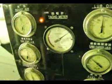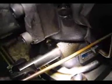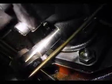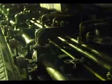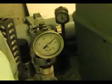Disengage the turning gear. Half an hour later, after primary lubrication blow-through, run the engine at no load. Check that all parameters are normal — there should not be any deviation beyond the limit between the fuel pump racks. Run for parallel operation for at least half an hour. Check for any abnormality, then run it on full load. A good performance will confirm that the fuel pump has been installed correctly.